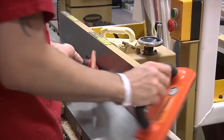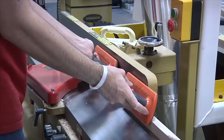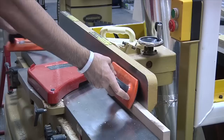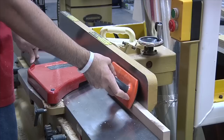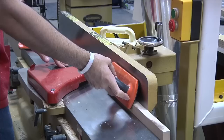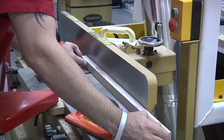I think it's important to show safety issues as they happen — here's some footage that would end up on the cutting room floor of a regular woodworking show. While jointing one of my side pieces, I hit a snag and the piece would not budge. My first instinct was to try tapping it loose — no luck. So I held the piece securely in place until the blades came to a complete stop. Turning the machine off was the right call. On tools like the table saw and jointer, when a piece becomes stuck, don't force it — just hold it in place, turn the machine off, wait for the blades to stop, and then analyze why it happened.